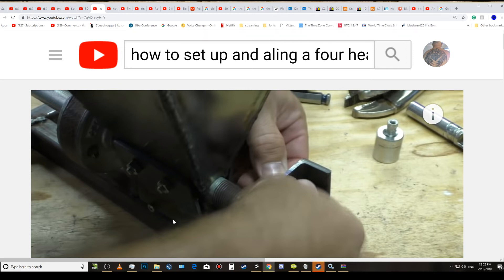Once it's been through the extruder, it doesn't need to be re-dried if it gets rolled straight away. But he's got to move that temperature gauge. If you're making one of these: don't use a rusty pipe. You can tell he's using an old pipe — that's why he's got metal in his stuff. The drill is chopping everything off on the inside. The more you use it, the worse it gets. Use stainless steel — you don't want rust in your product.